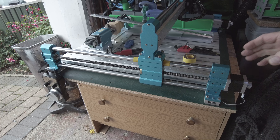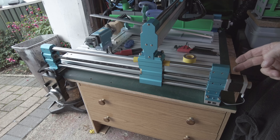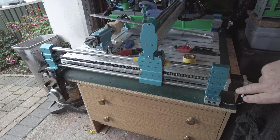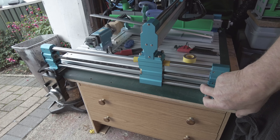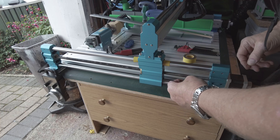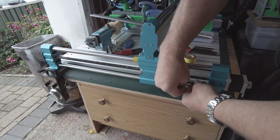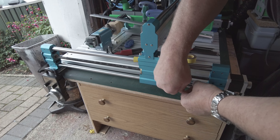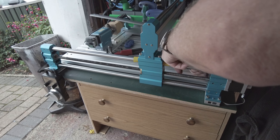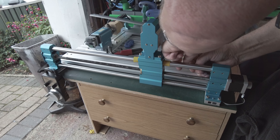The next thing we do is disconnect the stepper motor cabling — that's simple, it's just underneath. Don't get in the habit of thinking that the screws on the outside secure the motor — those hold the motor together. What holds your stepper motor on are the four screws on the inside. That's why you have to take both sides off.